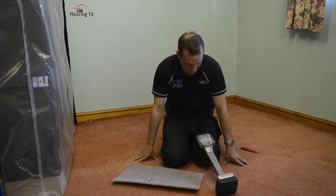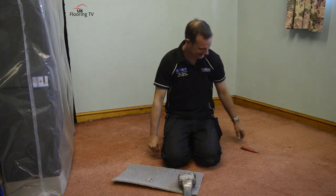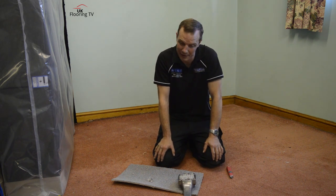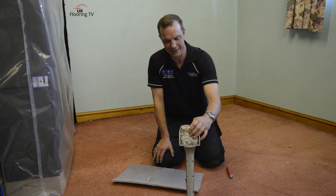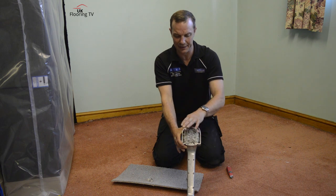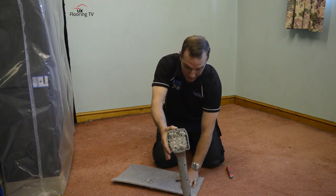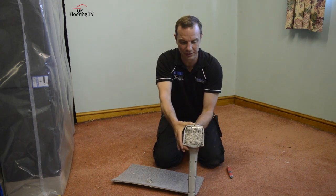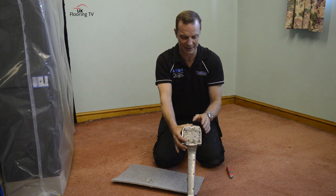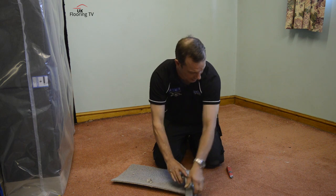I won't tell anyone it's yours though. So, the idea of keeping your kicker head clean is so you don't slip on carpets. You can see on your kicker head here where all this matted fluff is. These are your nap grips and they tend to stop the stretcher slipping on the carpet. And then you've also got your main pins by the side of it - they don't tend to get that bunged up. But we'll clean this out so we can see what's going on with it.